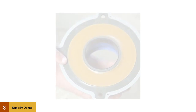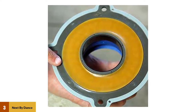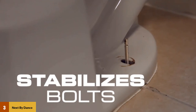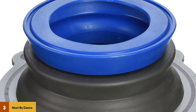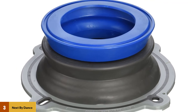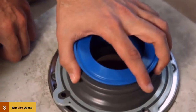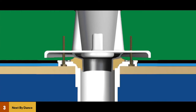The patented design makes a practical solution for the best toilet flange depths. There's no trouble getting a flush fit between the toilet base and the floor. It works for toilet flanges that are at a maximum of 0.5 inches below the floor, or 1.5 inches above. If need be, you can remove the black plastic ring at the base, allowing for full compression and a tighter fit. The seal comes with a complete installation kit, including mounting bolts for stability and easy repositioning, plus two caps that go over the bolts to create a seamless finish.